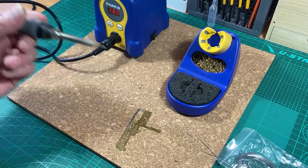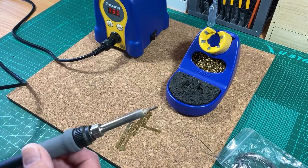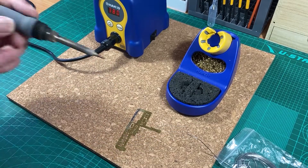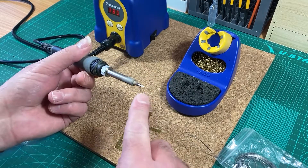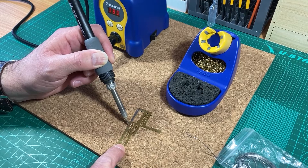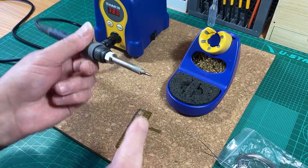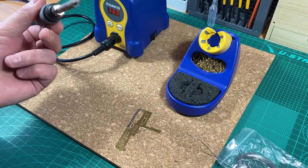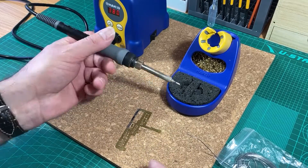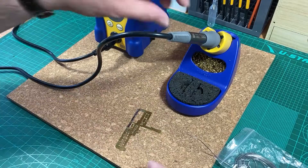On to the next part, just give it a quick clean — keep blasting the tip with the sponge. The other instance is where we want to melt solder that's already on the workpiece just by applying heat. In that case, we need to make sure there's nothing on the tip, because if there were any beads on it, as soon as you touched the work they would transfer to the brass — and that's what we want to avoid. Just put a little bead of solder on there, it picks some up, clean it off, and then move on to the next part. Get into the habit of just giving a touch on the sponge before each solder activity.